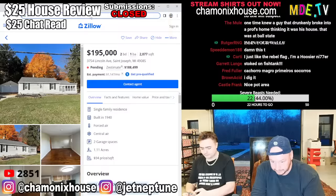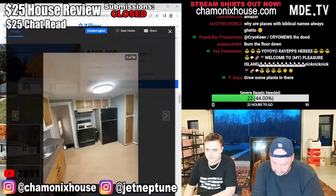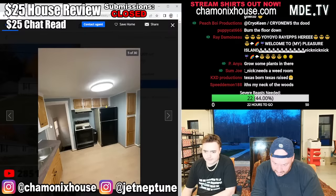Backyard needs landscaping. I would refigure the kitchen where I move it out, and then I would put a walkout to the back patio from the kitchen through that lower step out. I would bust this little door down here. I would bust this door down here and put an all glass slide out, putting a big beam here, sistering it, and then putting like a glass door, glass light with a larger opening, and kind of work this in a little bit better. Reconfigure.